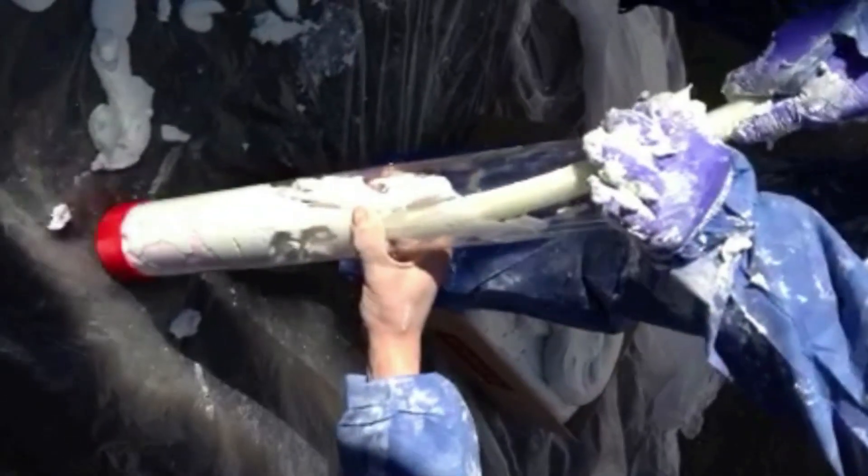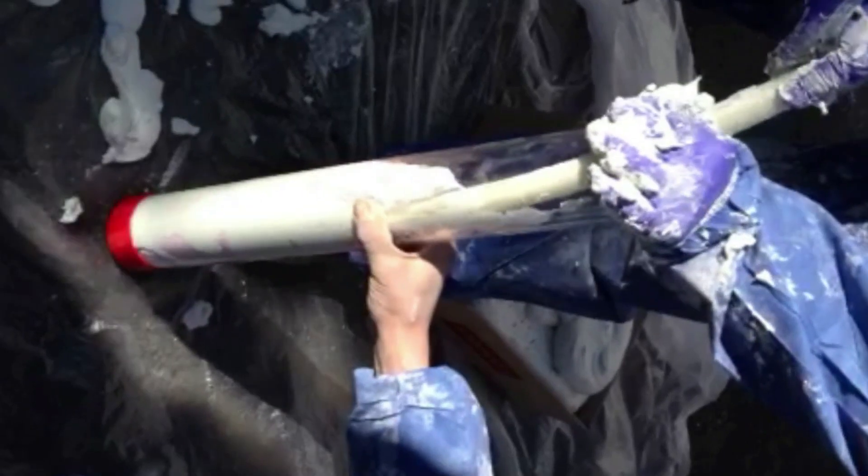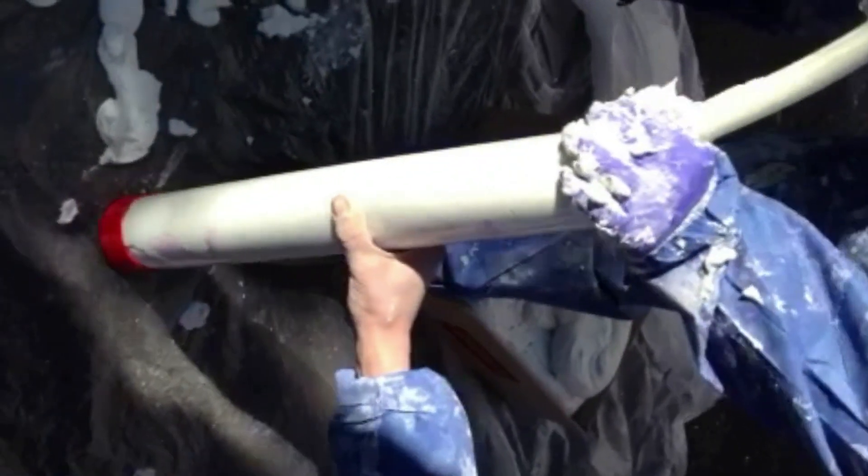The reason we put aircrete in the walls is for its insulation value and air sealing value. Its insulation value is approximately R4 per inch, which is very good. Just as importantly, the aircrete flows inside the wall and fills all the little gaps and spaces so air cannot flow through the wall cavity — whether from inside to outside at upper levels, or outside to inside at lower levels.